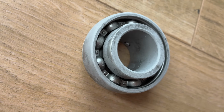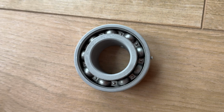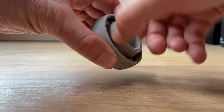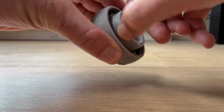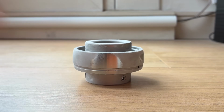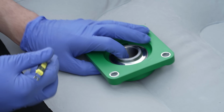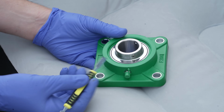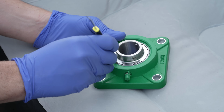I took it apart, cleaned it out, refroze it, and decided to go ahead with the lubrication swap. I just wanted to make sure it was just the hardened grease to blame and not a design issue. The empty, open, frozen bearing turns like a dream. So, back to the yard in time for the bearing's brother to endure my same surgical skills. I've been told it's very hard to open sealed bearings and work on them, so easy does it.